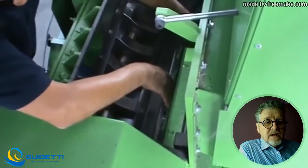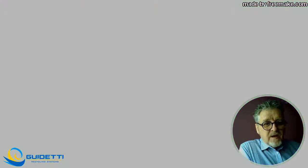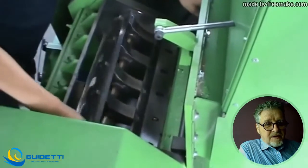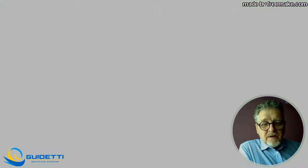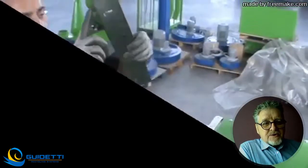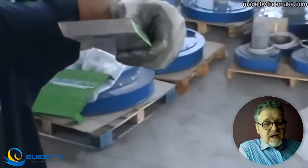Now the bolts are out and you can start to take out the holder which keeps the knife down. Then you can slowly take out the knife and control it. When you want to rebuild it — because it has been sharpened or is new — check carefully that the cutting edge is facing up, as shown. Then insert the knife into the base.